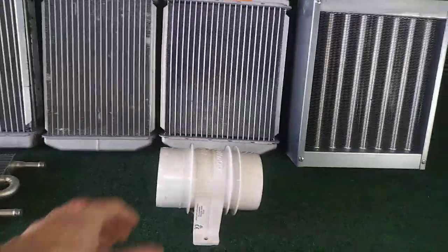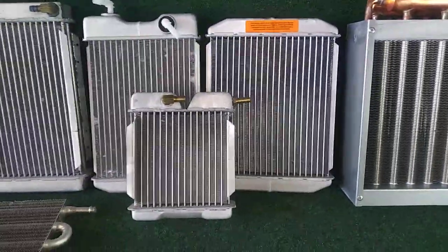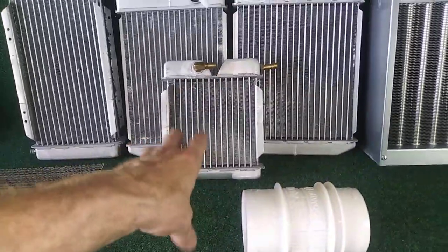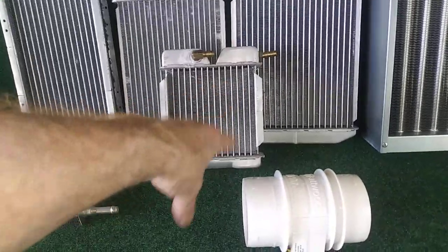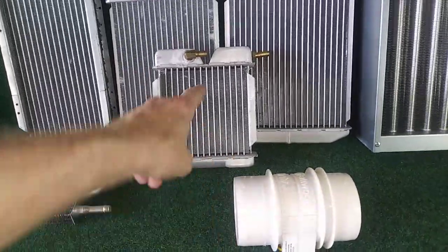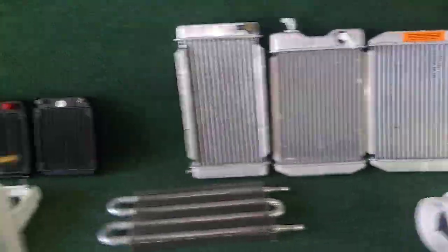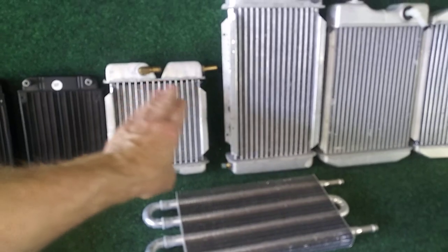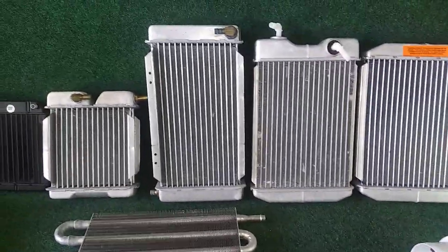As you can see, there's a big difference pulling air through. This fan was trying to pull all the air through that, and it was condensating — it was running too cold and it was filling up with water in all the little areas so it couldn't pull through. Maybe if you use two of those being thick like that I'll have to do a test, but as far as using it by yourself, the square inch surface space is too small for that one running really cold ice water.